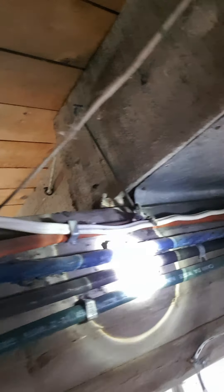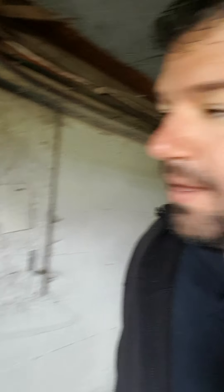But it doesn't end there because this is the type of house that we should be using as our learning experience. Come on over here. Let's have a look at some of this other wiring because this is not our knob and tube — this is our good stuff, this is our okay wiring. Except, let's come on around. This is our Canadian grade — who can see that word right there? That's right, this is our aluminum wiring. So we've got knob and tube and we've got aluminum in this house.